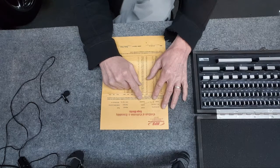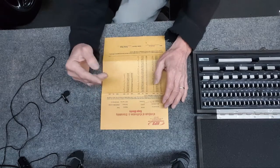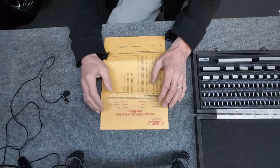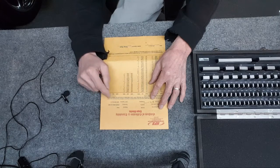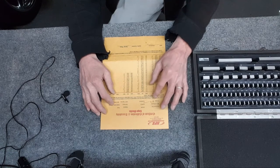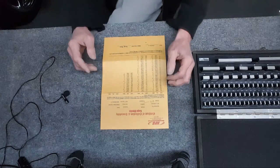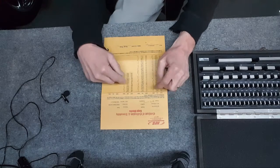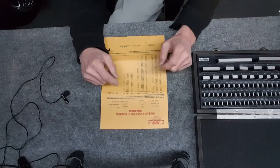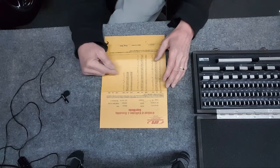What you really want to see is which sub-grade you're buying — grade 00, 0, AS1, or AS2. Each one of those grades has tighter tolerances and allows less deviation on each block in the set. The document I pulled up is grade B, and the loosest sub-grade is AS2 — it allows the most deviation. The maximum deviation for any one block in this size is up to about 24. Looking at this certificate, you see values of 28, 29, and 25 — that is beyond specification.